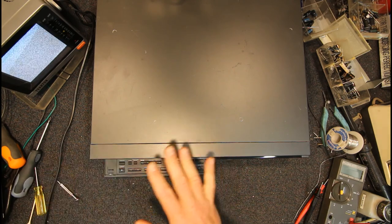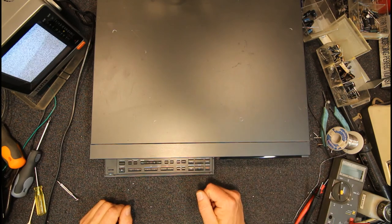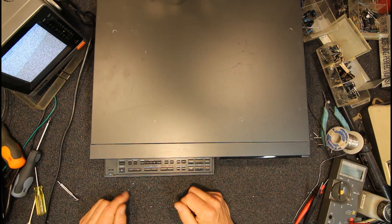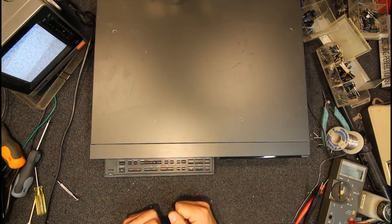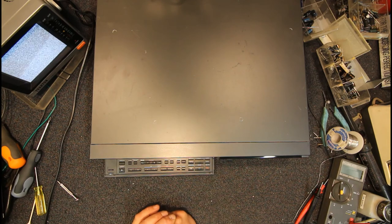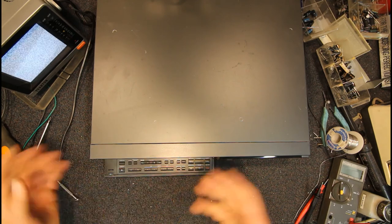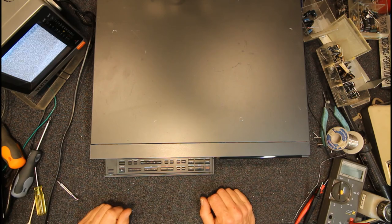Most of the time you won't find any problem with the alignment, other than like in this one where there's a broken bit on the loading mech and that's got out of whack. One of the tape guide arms of the lace up is broken, and you may have to pull part of it apart and get those bits that you take out realigned. It's very rare, I think I've only once or twice ever had to realign the whole mechanism, where someone's got a tape jammed in there and decided they can force it out themselves and they've broken things and got everything out of whack.